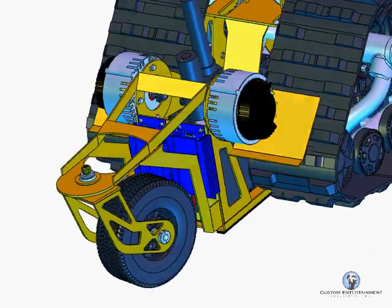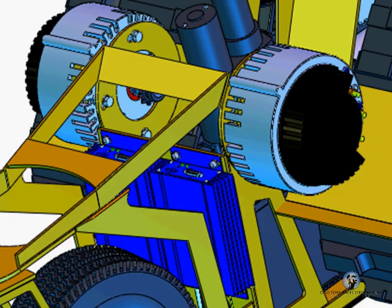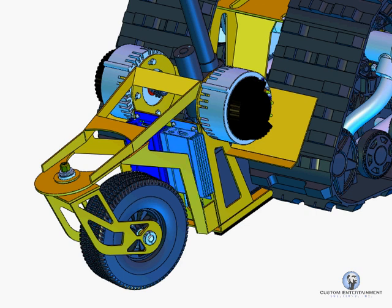So let's zoom in really quick on the motors and the drive controls. Unfortunately, we did try to push in brushless motor technology inside here. The motors were fine — the PMAC Mars brushless in-runner motors were great. Unfortunately the motor controllers you see there were completely dysfunctional and had to be returned. This is not a great thing, but sometimes pushing technology to the edge you run into this. It's not quite ready yet.